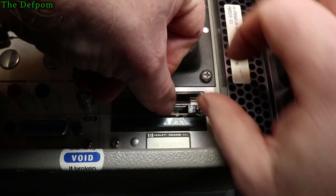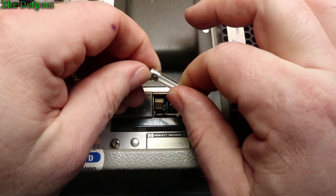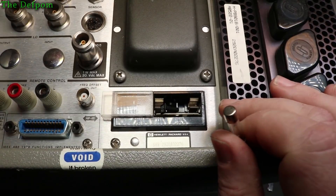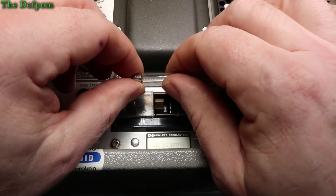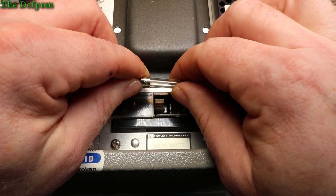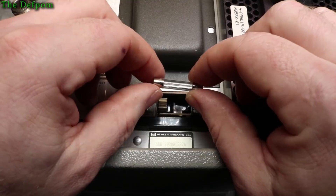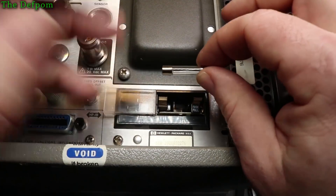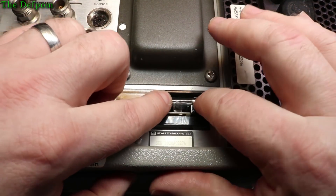It's always very important to remember to do that when you get a piece of gear. The fuse should also be replaced. Current fuse is two and a half amp, 250 volt. The manual says it should be a 1.5 amp fuse for 240 volts. I've only got a two amp or one amp, so I don't have anything between the two. I might even have some in a box somewhere, but I'll chuck a two amp in for now — it's still slightly better than what was in there.